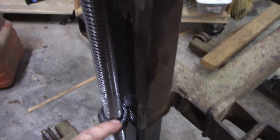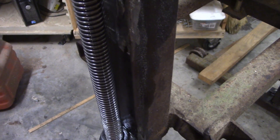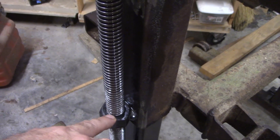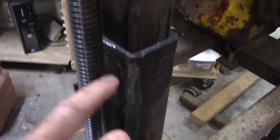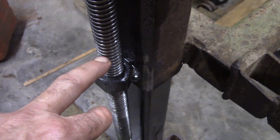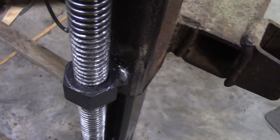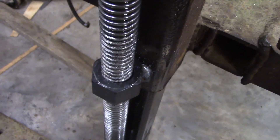This thing's so heavy it might take two nuts, but when you think about it, unless you've got it dialed in to the micron, only one of them is going to be lifting. What was happening was the bottom one was lifting and the one at the top was pushing down, and it galled the top of the screw. As I've been using it up and down it seems to be smoothing out and I think it's going to be fine. If not I can replace the screw — I'd just rather not have to do that.